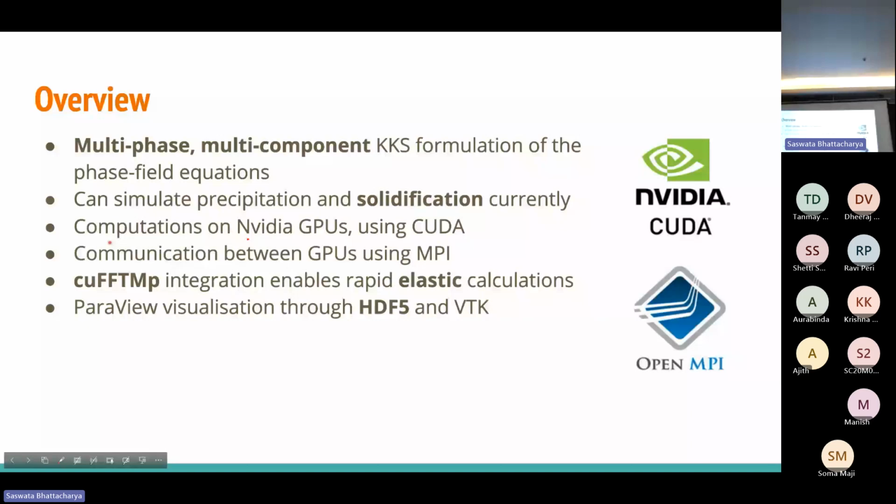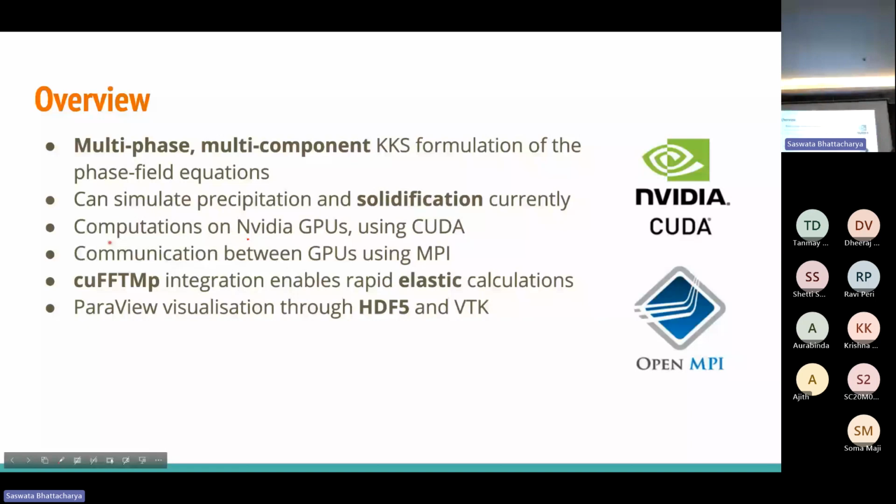By the way, coherent interfaces are one of the ways that all these different things work, including Boeing aircraft, for example, where the body is made of duralumin. Duralumin is an aluminium-copper alloy, and it derives its strength from those precipitates. And why do the precipitates give strength? There are two things. One is that the precipitates are ordered, right? And how do I distinguish order? We can distinguish it by using a phase field.